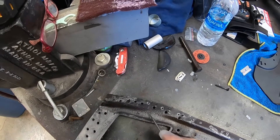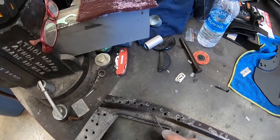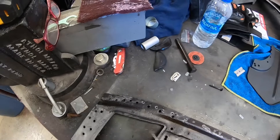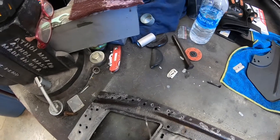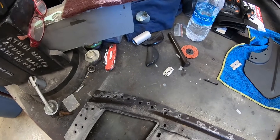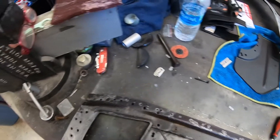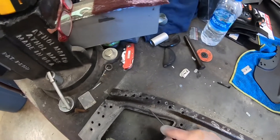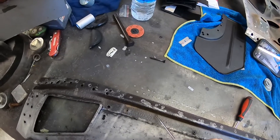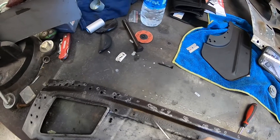You may have to do this a couple of times to make sure all of it is gone. The good thing now is I can take my wire wheel, come back over all the black, knock that black off, and see what's left. If there's orange under there — which there clearly is — I can just hit it again, hopefully going down into the pits far enough. But this is way overkill — it's just me trying to study to find the best possible way to eradicate rust on these older parts.